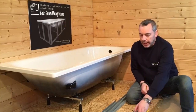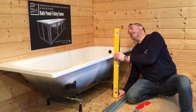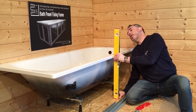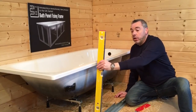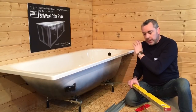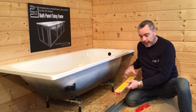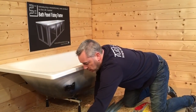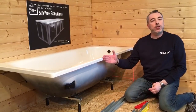The first thing we need to do is get our spirit level, put it up against our bath, get that dead level, and then we can mark the floor. We go along and do the same along the rest of the bath. If you have a laser level you can join up those marks and get a line. If not, just use your spirit level to join up those marks and physically draw a line with a pencil. We have a laser level here which will give us the front edge of the bath.